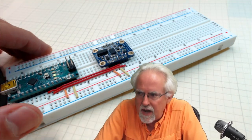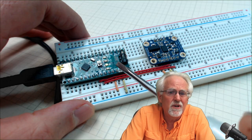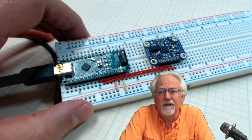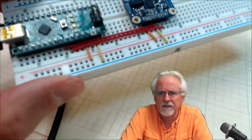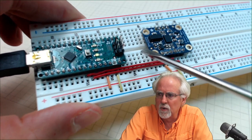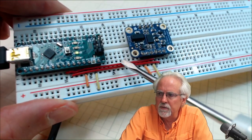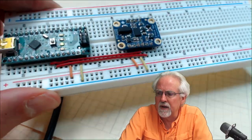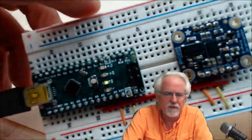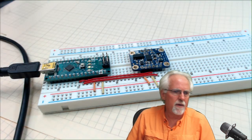Let's look at this nine-axis inertial measurement sensor — this is the BNO-055. As you guys know, I've really started liking the Arduino Nano and switched over to it for the later lessons. The Nano plugs directly into the breadboard, then you plug your sensor in, and there are only two connections between the Arduino and the BNO-055. You just establish your ground and power rails and you're ready to go — it takes a couple of minutes to hook up and you have a pretty clean, rugged circuit.